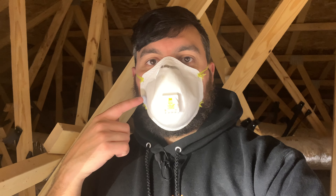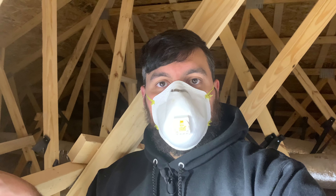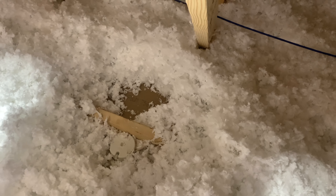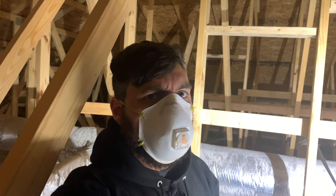We're here in the attic. I know that is where the front door is, and we want to mount the access point somewhere over here. We are looking for a light that should be somewhere around this area. All we have to do is find one of these white electric cables that would go to that lamp, which I think conveniently happens to be right there. This might be where the wall is that separates the foyer or front entranceway with the living room. So I think that's our candidate right there.